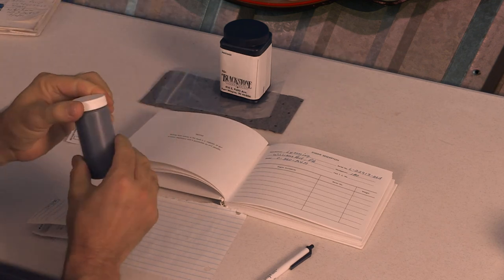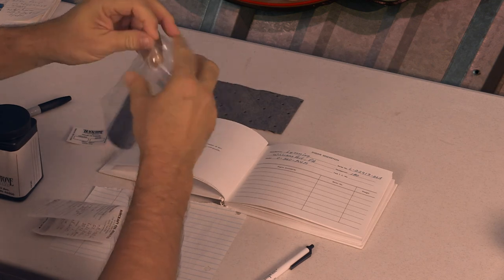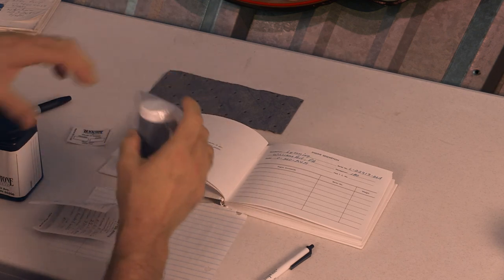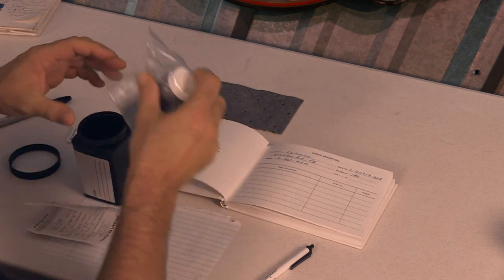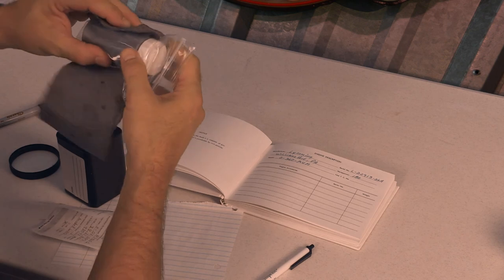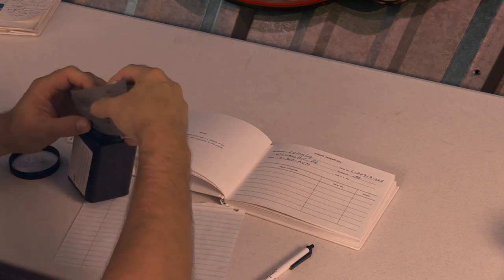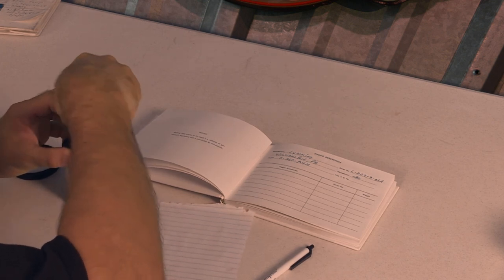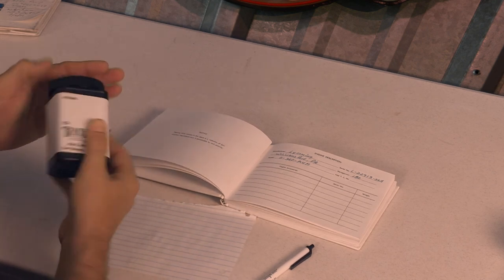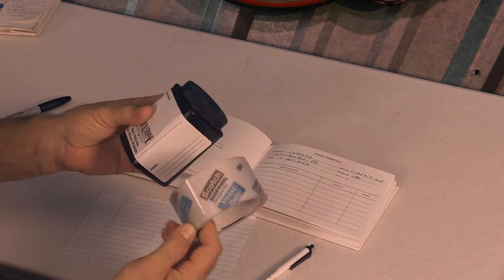We make sure that our oil sample is sealed — we'll tie them. We also give it a second layer of protection. We wrap Pigmat around it just in case, for some unexpected reason, it comes loose — the Pigmat will absorb the oil. Then we'll put our paperwork in here as well, seal the container, get our postage and fill this out. I always put some clear tape across it to seal the lid as well.